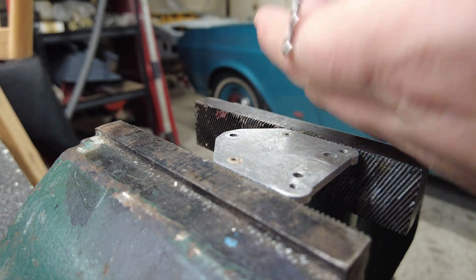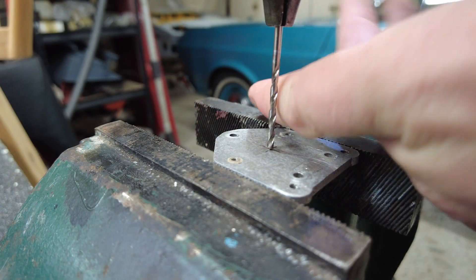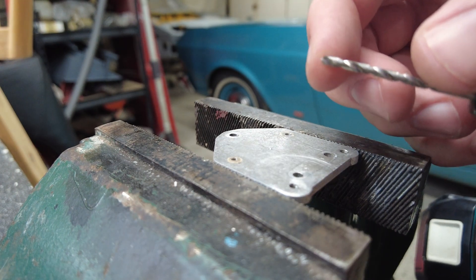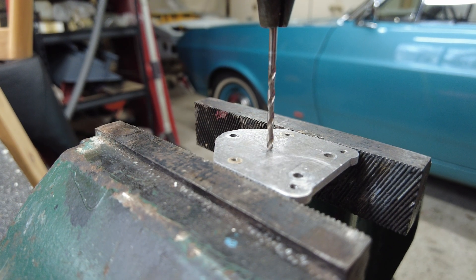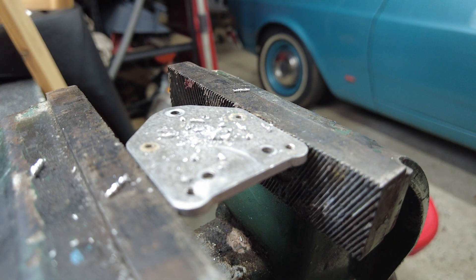I'm pilot drilling the hole at 2.5mm. By pilot drilling, we can relieve the spike in friction when the cutting tool breaks through. I'm locating the drill into the centre punch mark I made earlier, checking from two different angles to make sure the drill bit is 90 degrees from the work. When cutting metal, there's an ideal speed for the cutting surface. As you reduce the size of a drill bit, you need to increase the RPM to maintain optimal cutting speed. With practice you'll get a feel for when the tool is cutting at its peak. You may have actually heard the spike in friction as the drill bit broke through — reflected by a little chirping sound.